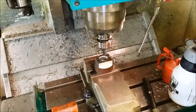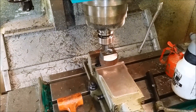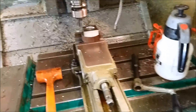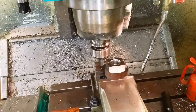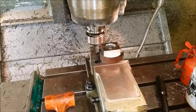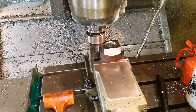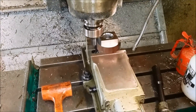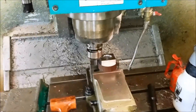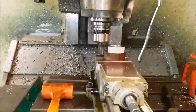Now it's going for the outside again. Because the end mill is so short I had to kind of cheat the program for the second pass — I set the tool to be one millimeter larger, so now it's leaving a step of half a millimeter per side. By doing that it is now possible to mill longer than the length of the tool.